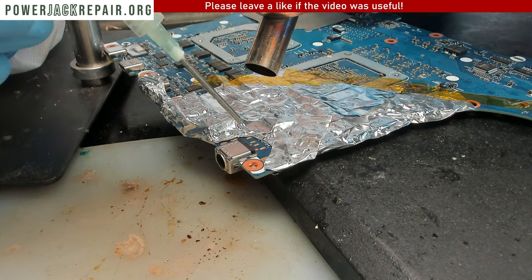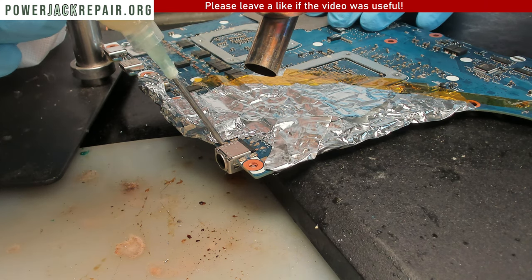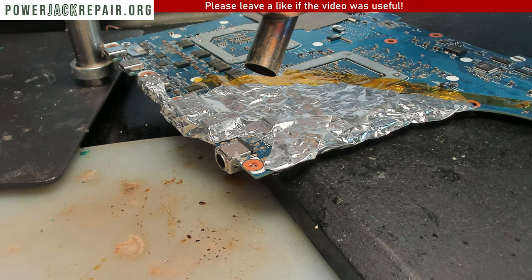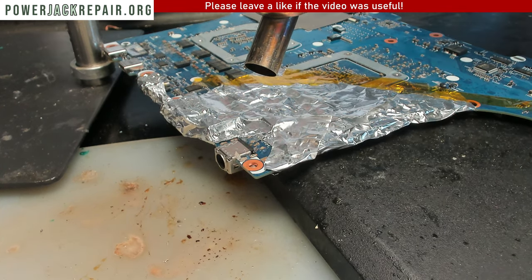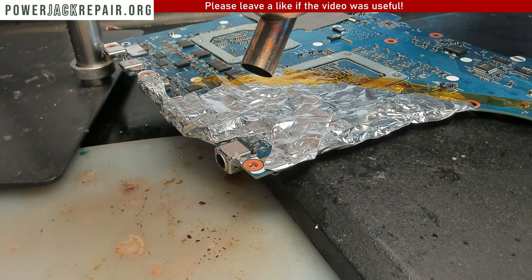All right, so here we add flux here, flux right there, flux right here. Flux is also toxic, so try not to inhale it or touch it. That's the reason why you use gloves. Is this camera on autofocus? All right. So what we're going to do is add some hot air to the equation. All right.